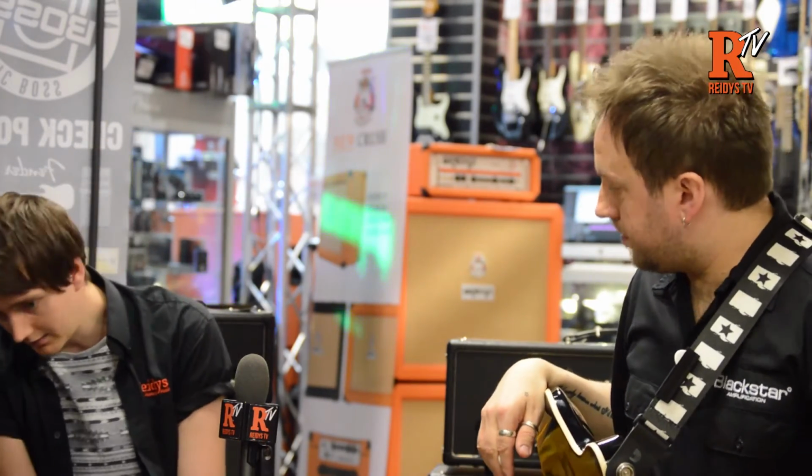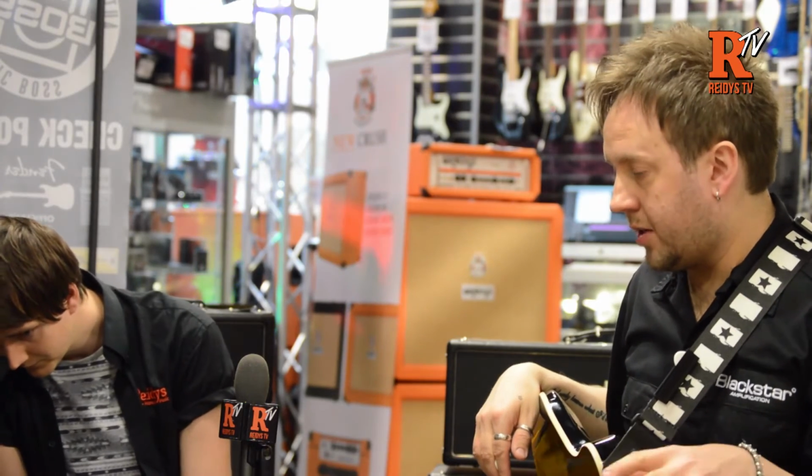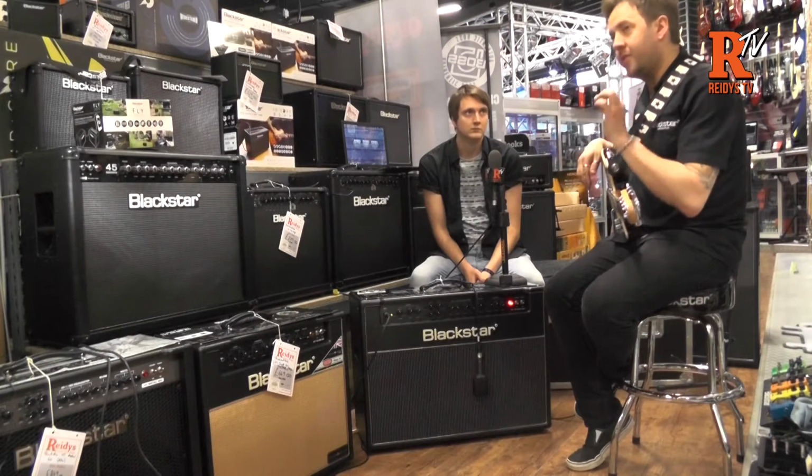There's also a lot of things going on under the hood of the amplifier on the reverse. You've got things like the reverb selection. You've got an effects loop with a dB increase or decrease. I can see that from the back. The reason there's a decrease or increase on the decibel there is for rack mount units or pedal units. Typically through the effects loop you might put things like modulation effects, delay effects, to bypass that preamp section. So it's a very clean response.